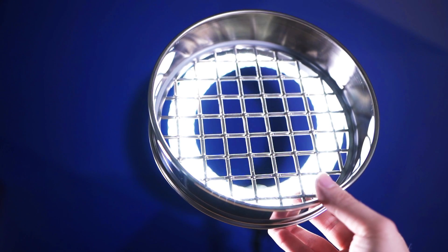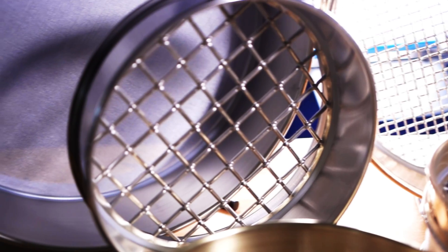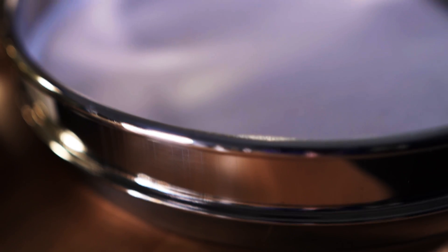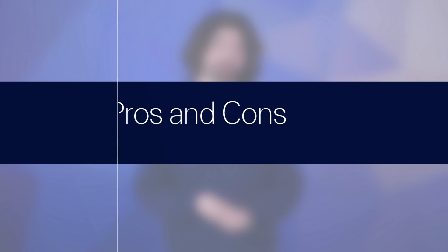The mesh in stainless steel test sieves comes from the 300 series, most commonly 304 and 316. Meshes in sizes US 8 through US 500 are all 316 stainless steel, with the other mesh sizes woven in 304 grade stainless steel. Frames are also from the same 300 series, with the most common in the field being 304, 305, and 316 stainless steel.